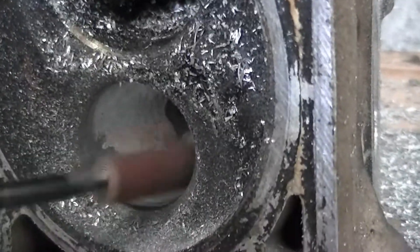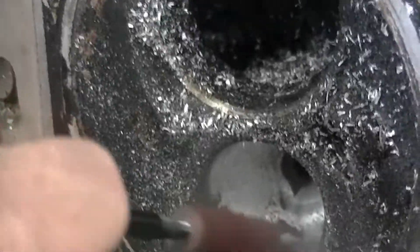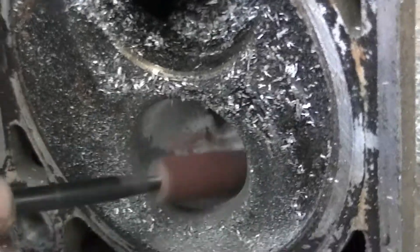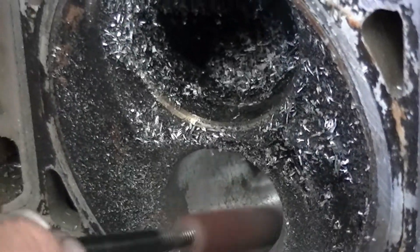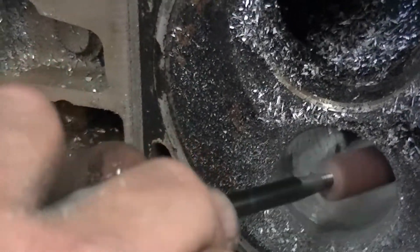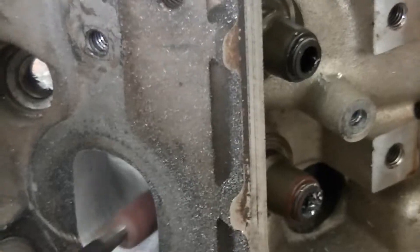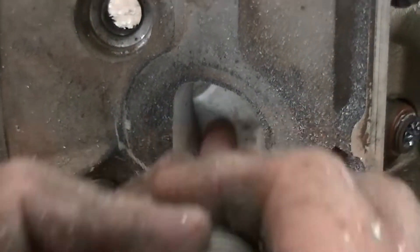He's not boosting this vehicle, so we don't have to be polished. Understand — if you want me to polish your heads to a mirror shine, you're gonna pay for it. But you'll notice we're starting to really clean this sucker up. Look how shiny it's starting to get — nice and clean, nice and roughed in. Now we'll go to this side and start cleaning up your rough casting that you did with the rough grit.